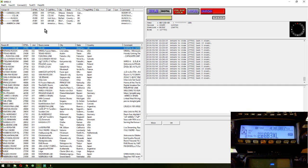So you've downloaded the firmware for the radio and that's now in. You've downloaded the software for the HRI200 portable node system from Yaesu, that's now up and running. You've got your ID codes back from Yaesu and you've put them into the software. That's the first thing you have to do - you have to put in the DTMF ID that you get back from Yaesu and the room ID that you get back from Yaesu. It's very important. If you don't put those in, you can't go anywhere with the software - it just won't do anything.